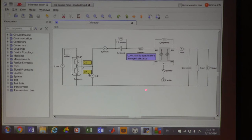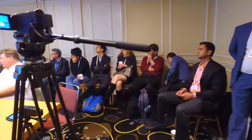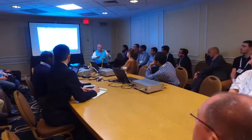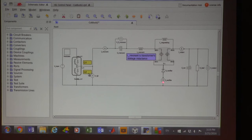This resonant circuit has a certain resonant period. Let's agree that resonant period is 50% duty ratio — let's say switching frequency is 25 kHz, so 40 microseconds total, half is 20 microseconds. We make the resonance 20 microseconds, and during the off period it is just resonating and cannot go negative. The waveform on the output always ends at zero and never goes lower.